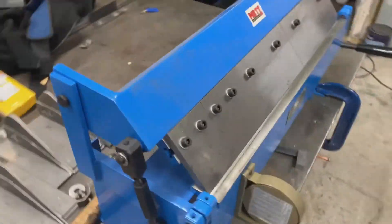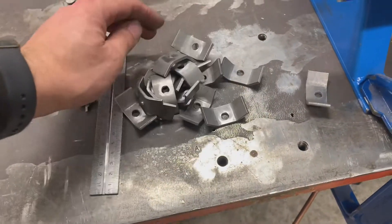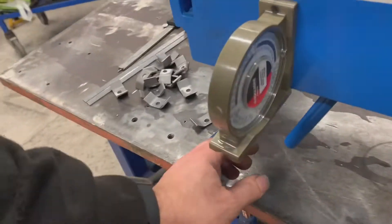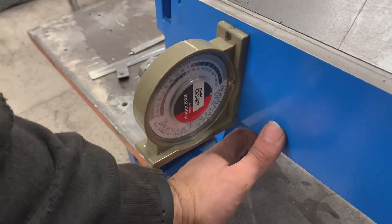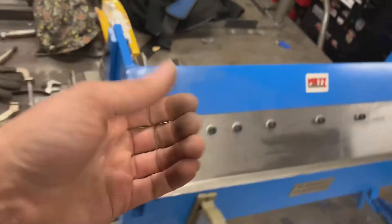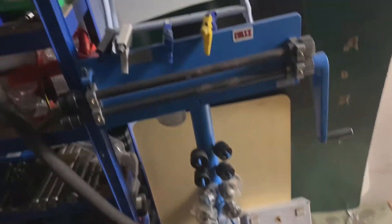Done - quick as that! It actually went really quick. That's all of these done. Once you get one of these, you just follow your degrees. I found to get to 45 I'll go to 50 and then you get a little bit of spring-back, and it just sits around 45. So I go over by five degrees. When I bought that bender I also bought a shrinker-stretcher, and I've used that quite a lot - that's a good bit of kit.